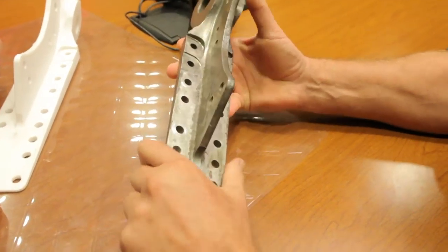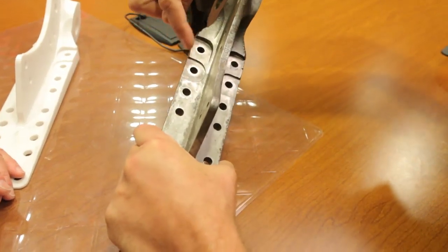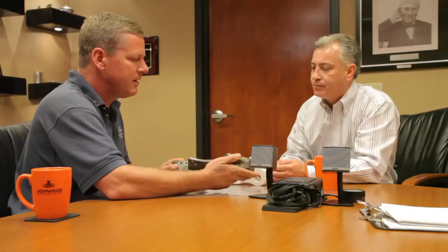So we talked about using laser technology to be able to continue to restore the aircraft engines and the aircraft itself. I'm really impressed with what you've done with the Corsair right down there in Chester, Connecticut — truly a dedication to a fine aircraft built here in Connecticut back in the 1940s. You brought some parts here today, so let's talk about how we can apply laser technology to restore the part versus having to make parts over again. This part was probably built about 1942 or 1943, and this is the wing hinge attach fitting for the Corsair — the main upper hinge fitting that holds the wing on and allows the wing to fold so it can be used on an aircraft carrier.